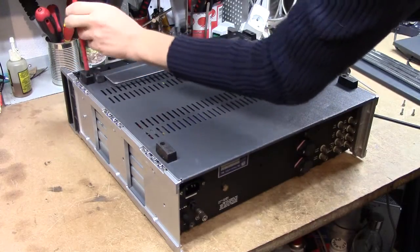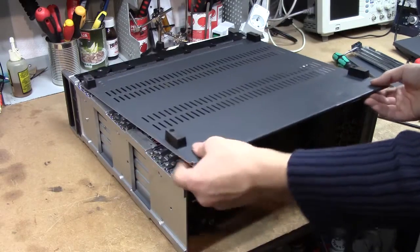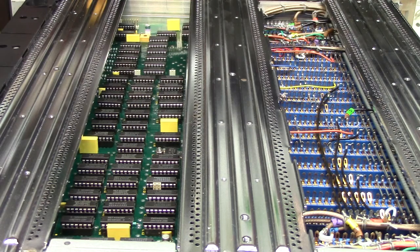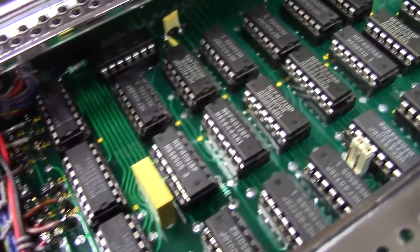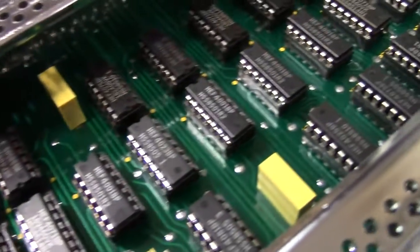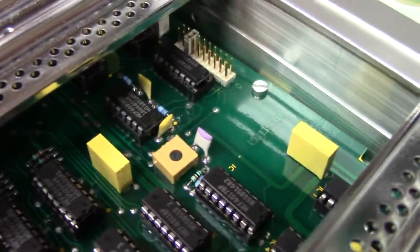And to get the underside off you just unscrew the feet and we should be in. Now that's another beautiful sight — there's got to be at least 50 ICs here. They seem to be mostly 4000-series logic, and all of them socketed with no exceptions. Philips definitely sprung for 4000-series logic in this thing — 4000-series all over. So this is where the brains of the unit is.